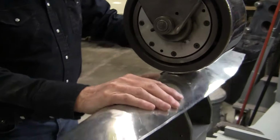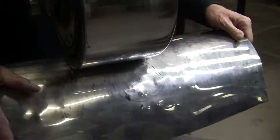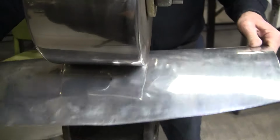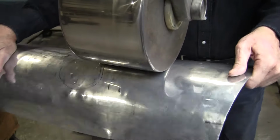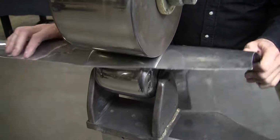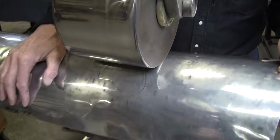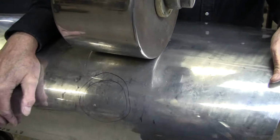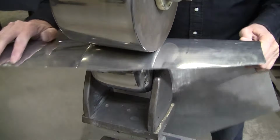So the wheeling is just these little back and forth passes, and if you just go back and forth, that can potentially lead to a problem too, but not until I get it smooth. We're still in the lump phase. We're going through there and it's bump bump lump lump, but then it only takes a matter of minutes before it smooths back out, and then you have to drag it in so you blend it with the wheel.